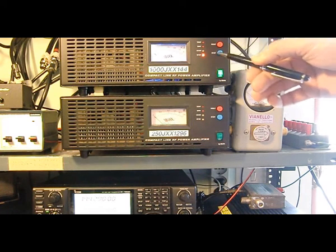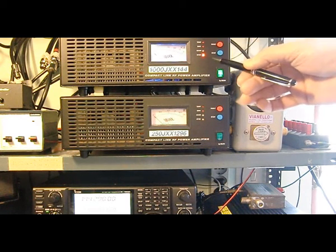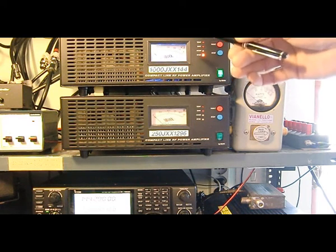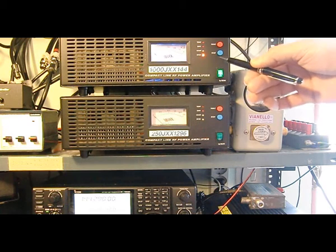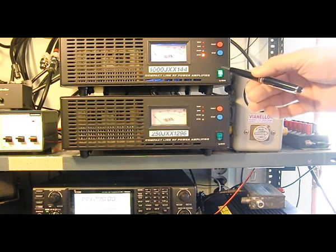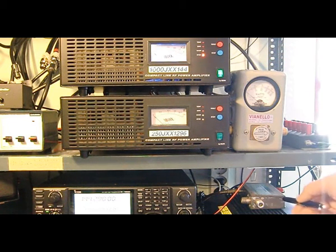It's mandatory to send PTT with a short delay, as no preamplifier can manage such a power with VOX, and coaxial relays need some milliseconds to switch. I use this one since a long time. I even cannot remember when I bought it.